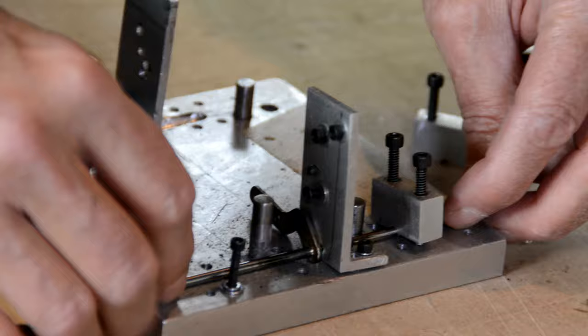Then you remember to put your bearings on here before you do this, which is a mistake we've all made, probably bending these things, forget to put the bushings on them. Then when you get ready to do the other side, you move one of the clamps to this side. This is only a precautionary thing to keep from maybe bending this one you just bent out a little bit more and pulling it back the other way, and it will pull a little bit. Clamp this back down on this side and then make your second bend.